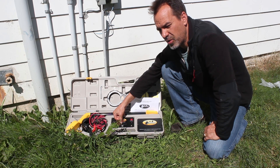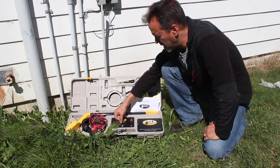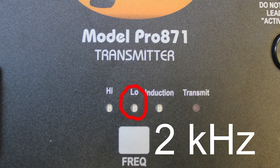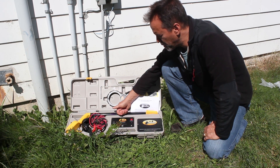The 33 kHz high frequency is used for direct connection locating — it's a general purpose frequency. If I hit the button next, the LED changes to low, which takes it to a 2 kHz signal. Same thing, general cable locating. You can choose which of these two works best for you.